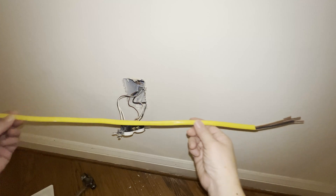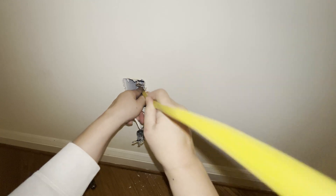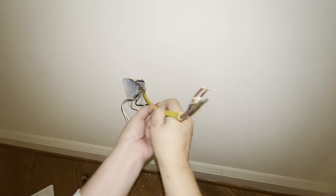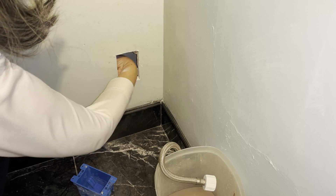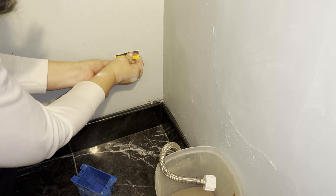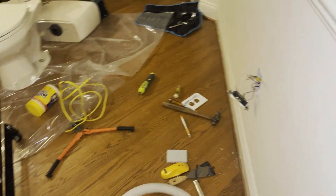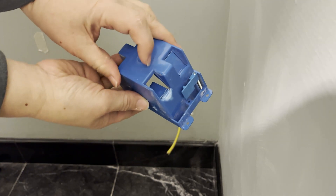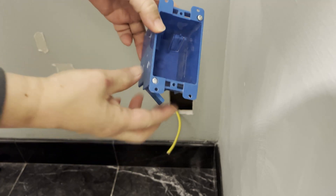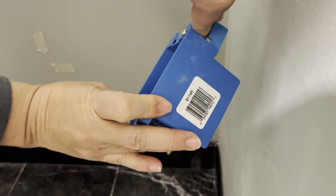I only needed a cable that's this long to connect the two outlets. I'm feeding the wire from this box to my new box. This is a used electrical box that already has a hole punched out for the wires. When you turn these screws in after inserting the box through the drywall, these tabs open up and the more you drive in the screw, the tabs get pushed forward into the drywall to help keep the box firmly mounted.